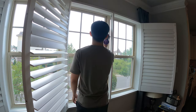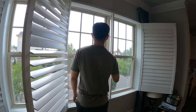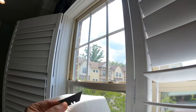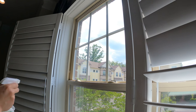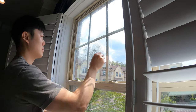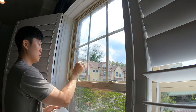In terms of prep work, you'll first want to vacuum all the dust and spiderwebs around your windows. It's gonna get a little bit messy later, and you don't want any debris to end up between the film and the glass. You'll then need to razor blade the windows to remove any bumps or stubborn residue. Anything other than a completely flat, clean surface will show up when you apply the film and make it look awful, so take your time with this.